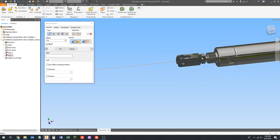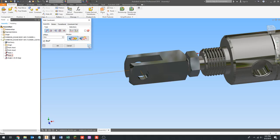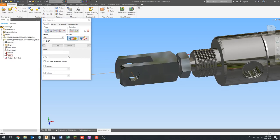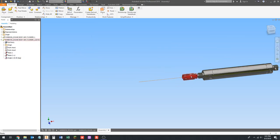This represents it in the retracted position, and out in the extended position would be four inches farther. Depending on how Inventor comes up by default, your dialog might look collapsed — click the double greater-than symbols to expand the region underneath. Check both maximum and minimum: maximum is going to be four inches, minimum is going to be zero. Click OK. The mate shows up with a little plus-or-minus beside it indicating a range. If we click and drag on this clevis, it will move in and out — and I can't get it to go past the four-inch extension point.